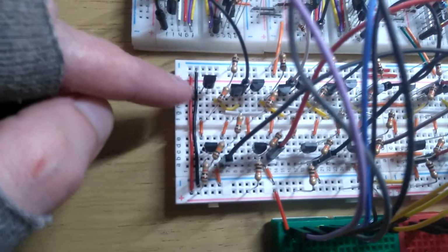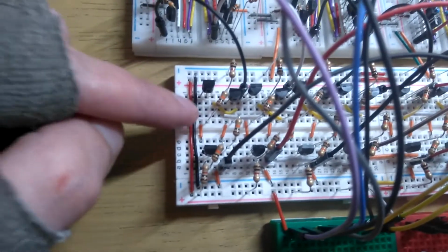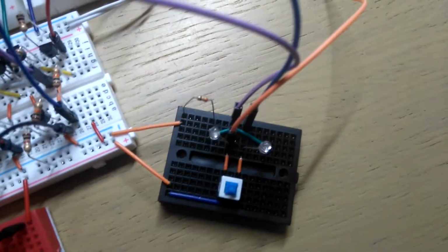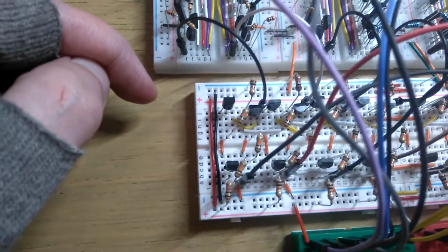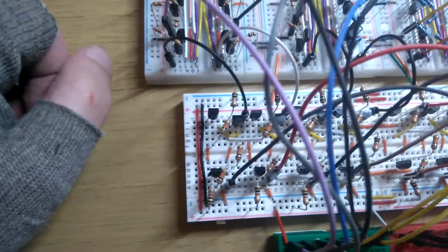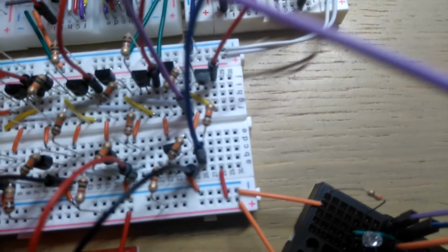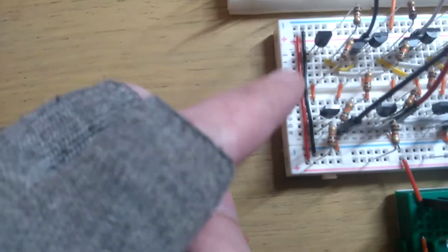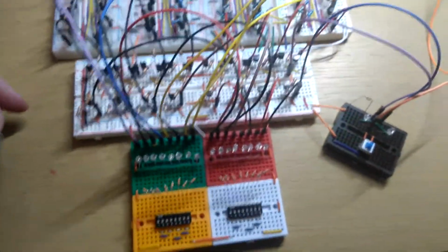So these are two gates. One of them has the inverted input, one of them has the normal input, and this switch here just decides which gate to open and whether to use addition or subtraction. So it's pretty simple, and that design just happened to fit on one board basically perfectly. I've got two rows left there, and two rows here are used up by these, just to transfer power over. So yeah, they just fit.